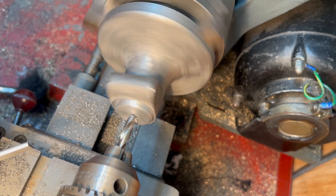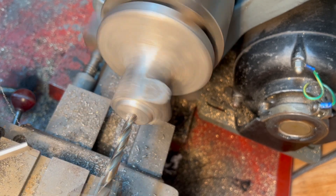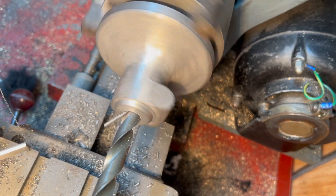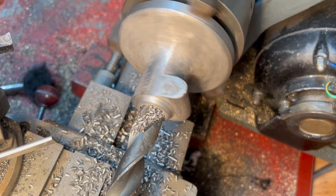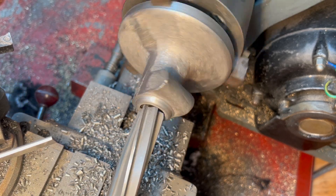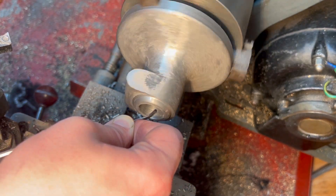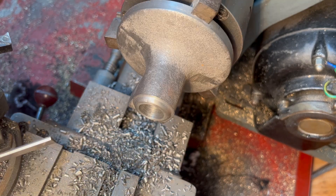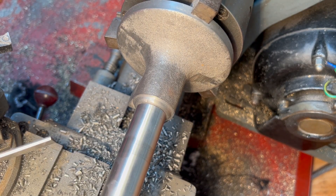I'm spot drilling here again and then I will be going with increasingly large drills and then back to a reamer to get a nice reamed hole down the centre that will allow me to clamp the shaft in place. Now we're getting into the really large drills so I've put the lathe into back gear. Even slower now in the slowest gear the lathe does for that reaming, because I don't want to get it oversized. Just take off the corner there with the deburring tool, get the dust out and do a bit of test fitting. Pretty happy with that.